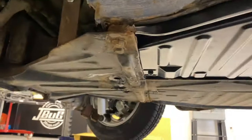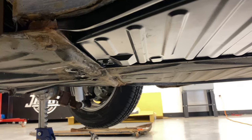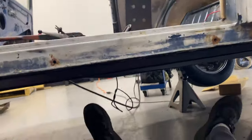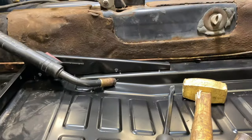Overlapped that tunnel piece all the way across the back. Butted up and slightly overlapped on that front seam. And sitting inside the pan all along the tunnel. So we are ready to go with one side floor pan just about installed. Not sealed, but at least she's installed. And well, now it needs to be welded. So I'm gonna get to that.